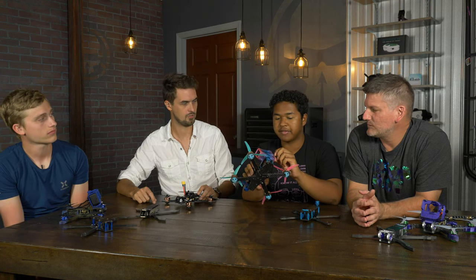Tank. Whoa! Wow, I did not see that one coming. Me either. So here's the thing. For me, the most important thing is flight performance, and you're like, well, why did I go with the heaviest frame? Well, the reality is these three options are all very, very heavy. So the biggest noticeable difference is in the aerodynamics, and that's with the thin arms. Second, from a tuning standpoint, it is much, much easier to tune with more of your weight in the center, and that's what you get with the toilet tank setup that you don't get with your batteries long ways. And from a durability standpoint as well, like Shawn and I talked about, your battery does not eject into the back of your GoPro. So I would go with this frame 100%.